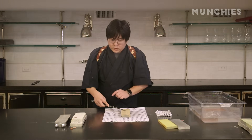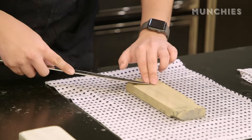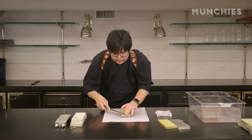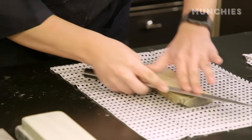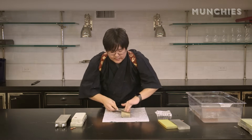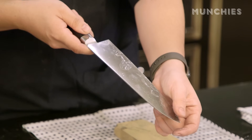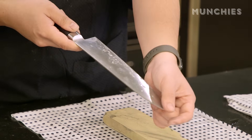I'm going to start by sharpening the tip and working my way down. However, this time the edge is facing me, so I place two fingers right on the tip and press firmly as I push straight up, let go when I come down, and repeat. Then I move my fingers slightly over and work my way down the knife in sections. Since we're working on the dominant side, we're going to work on this side a lot longer. Eventually there comes a point where that edge will fold over and cause a ridge — what we call a burr — to form. The goal is to get a burr evenly from the heel all the way to the tip.